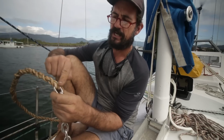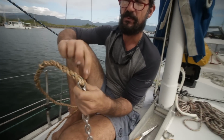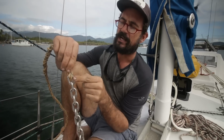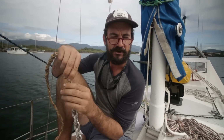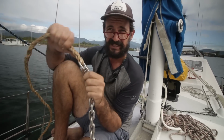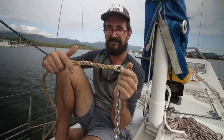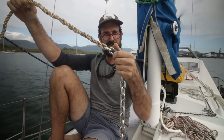You'll see that I put 2 strands through here, and then the other one just sort of came around and, well, one was sacrificial, wasn't it? It unwound, and 2 went through. Essentially, if you've got any rigging experience, you'll know that when you basket a load, it's not exactly like on a round load like this. It's thicker than the rope, so, I don't know. There's 2 bits supporting the load, but it's not twice as strong. It's about 1.7. Call it 1.5, but you've got 2 of them, so 1.5, 1.5, that's 3. So you can argue the point, but I've had a bit of a chat to some rope manufacturers about it, and apparently this splice maintains 100% of the rope strength, if any splice can be said to do that. But there we go, that's a very slim finish rope to chain splice.